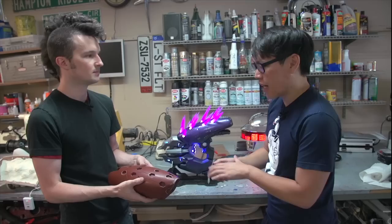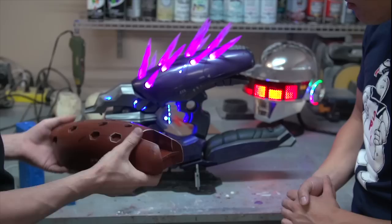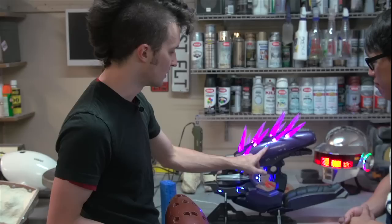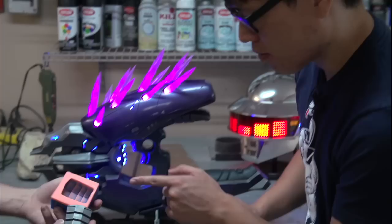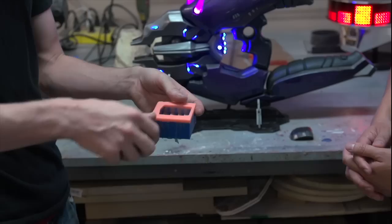After you've sculpted and finished the prototype, you cast it. This piece looks obviously like that, and if I painted both, they'd be virtually identical. The problem is the inside of this is a spider web of foam and MDF — it's heavy, fragile, and very difficult to run electronics through. The end goal is something lightweight and durable, and that's what all this is: urethane resin. You take a part and make molds. This, for example, is a simple mold of the back part — an inverted copy made out of silicone. You pour a two-part resin in — just two different color plastics — dump it in, and after a little while it sets and you pull out a finished plastic piece. You repeat that for all the parts.